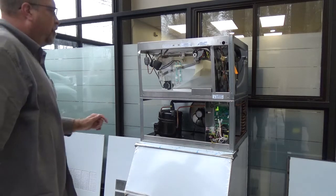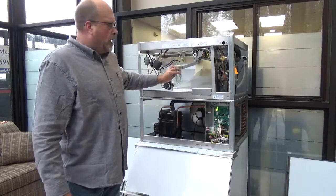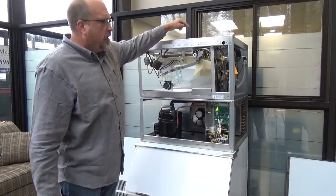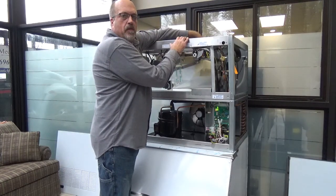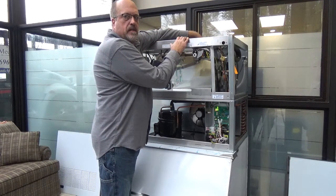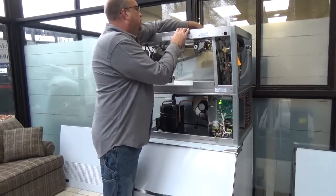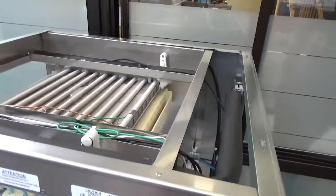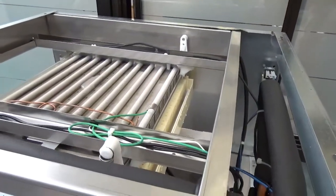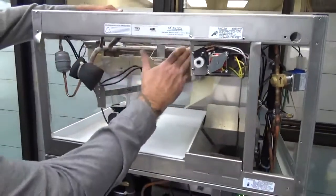You don't get on many 4x4s anymore. One is usually your evaporator probe, and you can see the evaporator probe is hooked to the evaporator right on the right-hand side here with a stainless clip. Like I said, that's going to go away, hopefully, but that's where that's hooked down to. Pull it off, check it, put it in ice water. But you've got good frost, everything looks good.